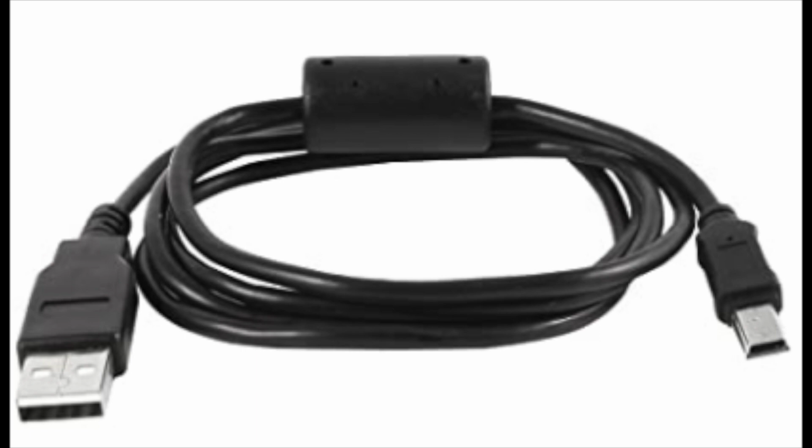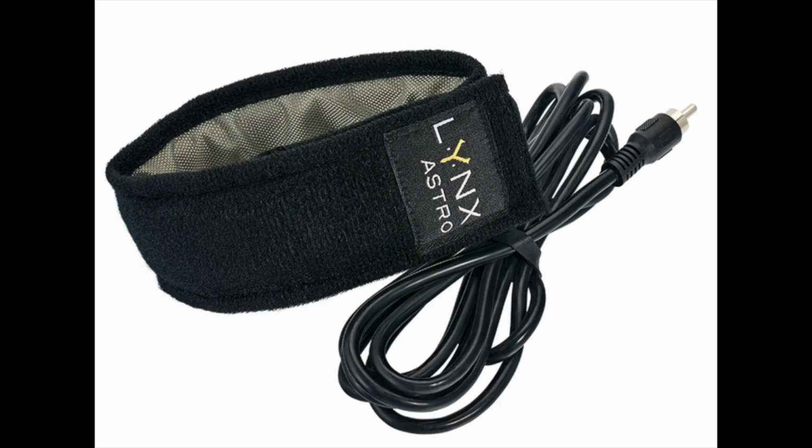So obviously over time, using the camera, using the telescope as your primary lens, you start on the late dark nights to have dew problems. As the temperature gets low, that creates the dew around the lens and obviously fogs or mists the lens up, stopping decent images or any visuals really. So this is where I then added a dew band, just placed around the primary lens, heats the area up, stops the dew forming, which is great, but yet again, another cable that has to come from the equipment.